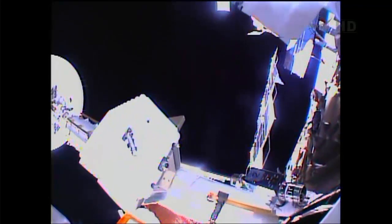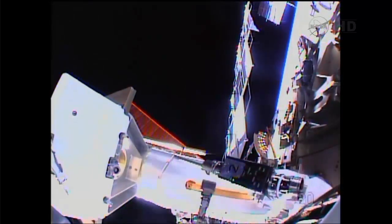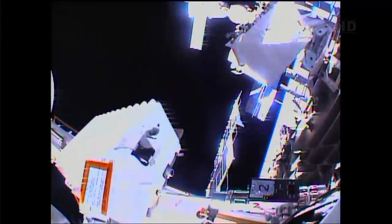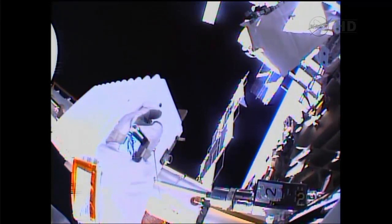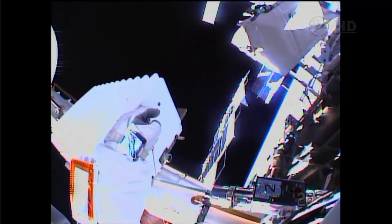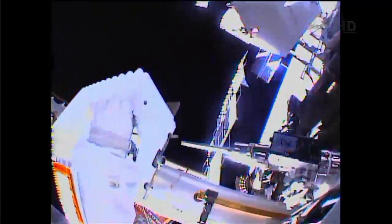What kind of settings would you like for those guys? So, Chris, for those, Alpha 1, Clockwise 2. Alpha 1, Clockwise 2. Here we go, Shane. Working on the forward bolt, 8 for 16. Barely any torque, running torque. Copy, should be 10 to 13 turns. Or 10, my bad. It is 10 and a quarter turns, 2.5 foot-pounds, green light. Copy on the forward.